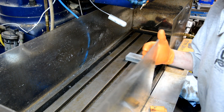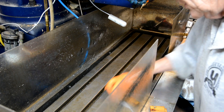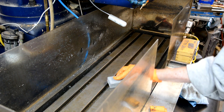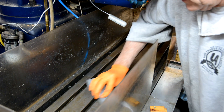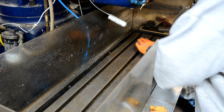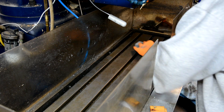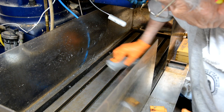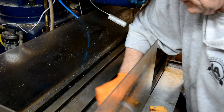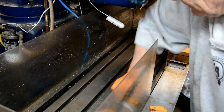I'm going to machine that fiberboard off on this machine. Right now I'm trying to get it within a thousandth. I know my quill is accurate to half a thousandth. I've got to get any little bumps out of here, so it doesn't throw it off — just a little tiny bump could throw it off half a tenth or something. I've never had this machine scraped but I've measured it and it seems to come out fairly flat.